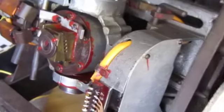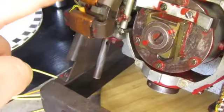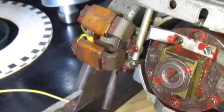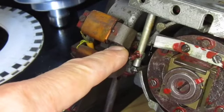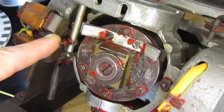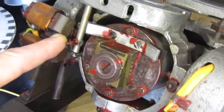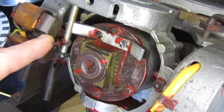If I now look at the main gyroscope of the autopilot you will see to the left of it there are two electrical coils. These are electromagnets which pull a little magnet either towards one of the coils, so upwards or downwards. And now I'm putting a little bit of force with my finger on this little anchor and you will see the effect on the gyroscope.